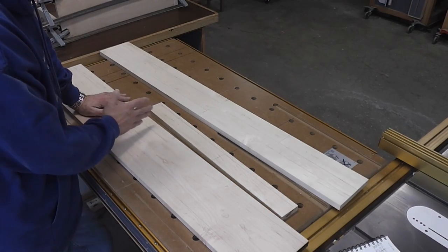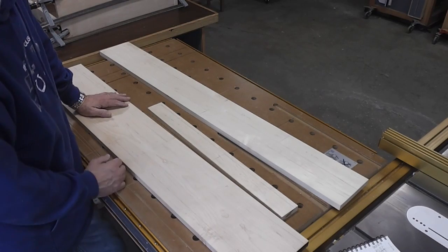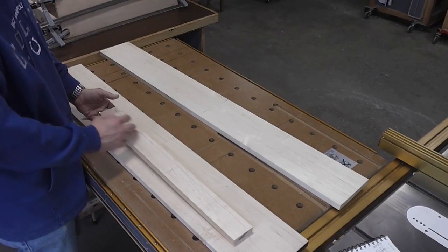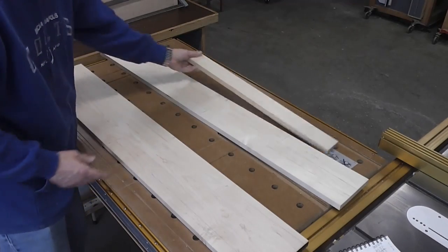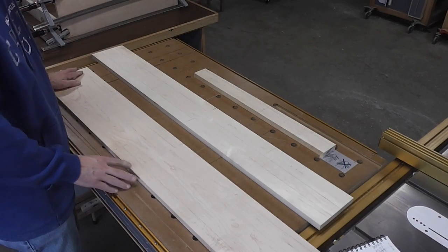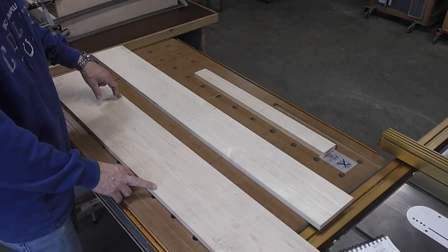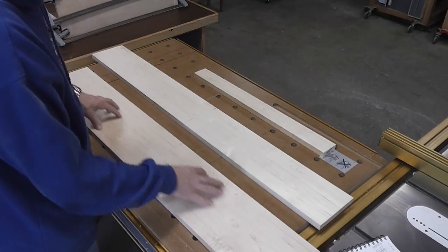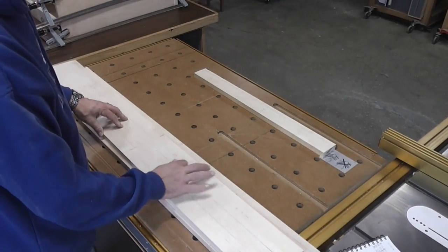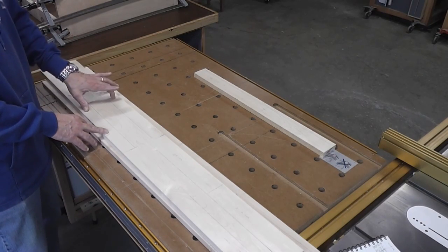If you've ever watched some of my projects before, I like to — especially on the top and bottom — have the grain run through both sides. So this is going to be the top rail. This is the left and right side, and I've marked it to make sure I don't get confused, because I get confused very easily at my age. This is going to be the inside left stile and the inside right stile. All this leftover material is not going to be scrapped — I will use it for something else. And then this board, I'm going to cut the two bottom rails left and right, and then the outside stiles left and right.